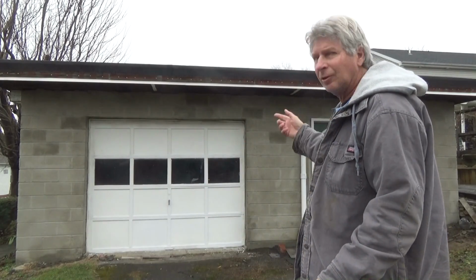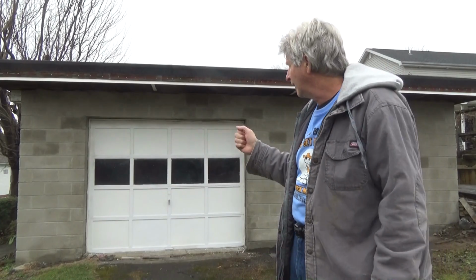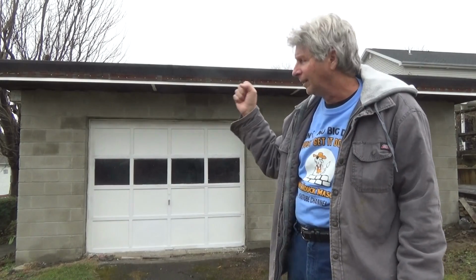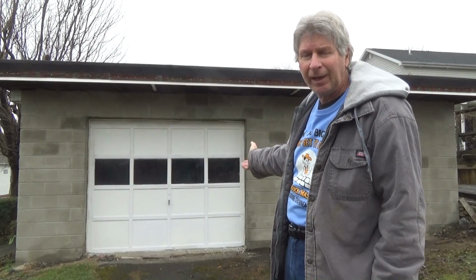But if you wanted to use real paint, you got to patch the holes anyway. So the first thing you do is I got that fast drying cement, and I got those sponge floats, which was old, and I just fixed it all up, patched it all up first. And then the cement, the old school whitewashing, you use a regular paintbrush. You don't use a roller. Roller won't get in there. You got to get into those grooves, you got to wet it.